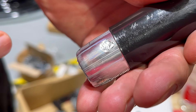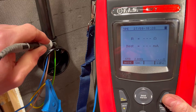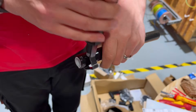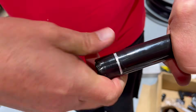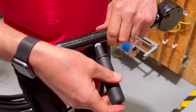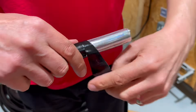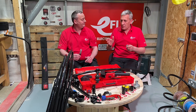You can use it as an earthed metallic sheath for screening. There's a grub screw on the box which screws into the aluminium, and when you earth the back box you pick up the earth for the whole system. We did that on our conduit system here — first attempt with Super Tube — and got a very low reading when we measured it. The additional step required is exposing the aluminium inner core by removing the black outer sheath as you put it into the box. There's a special tool that works like a ringing tool to create that first ring, then you can flip it around and create a spiral action to remove the outer sheath.